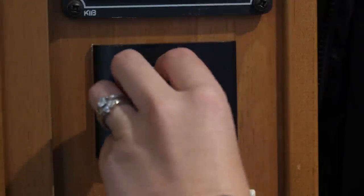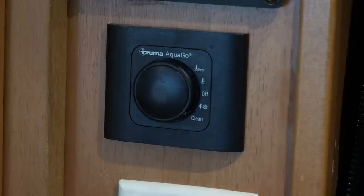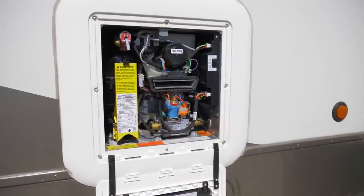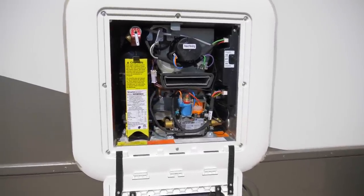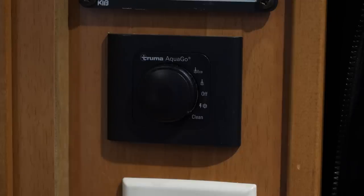Once the system is bled and the taps are shut off, set the control panel to the clean mode. The control panel will indicate that decalcification is in progress by a slow flashing — one second on, one second off — status light. During decalcification the control panel must remain set to the clean mode and no water can be run through the system. You will also hear the internal pump running in the water heater. The decalcification takes about three hours and the LED status on the control panel will start to flash quickly once it's complete.